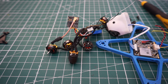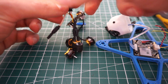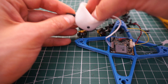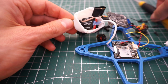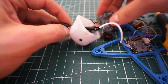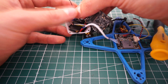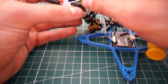I link all those components in the video description. Wrap some electrical tape around the TBS VTX, then using a bit of force you can push the linear antenna right through the little hole. Do the same for the receiver and make sure the antennas are facing out.